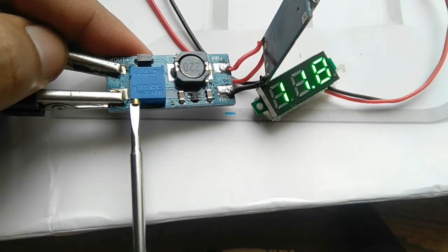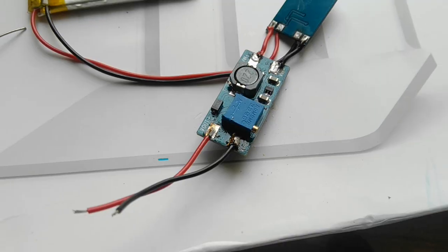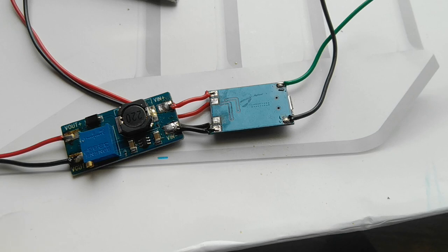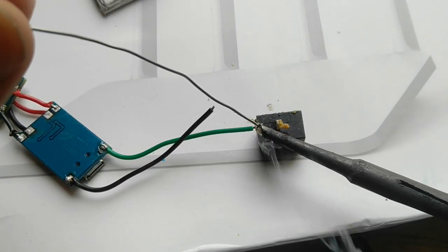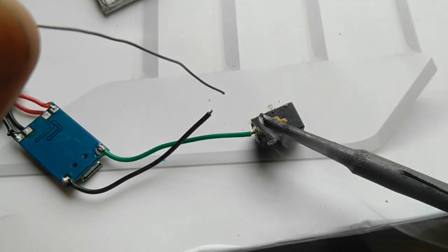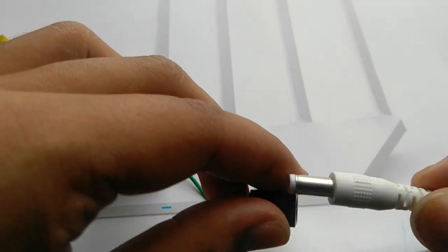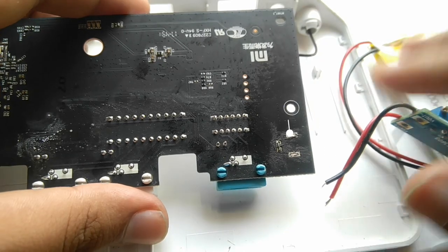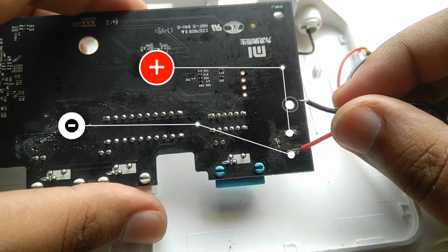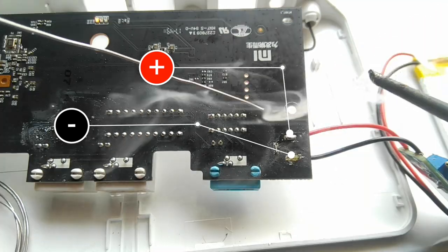Here that's 12 volts. Now just solder wires to the output terminals of the voltage booster. I have also added wires on the charger circuit input — then you just need to solder positive to the outside terminal and negative to the middle one. Once you're done, don't forget to test if everything is working fine. After that, solder the voltage booster's output wires on the router's input from where you desoldered the power jack.